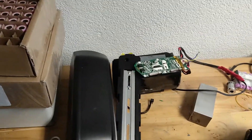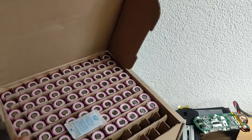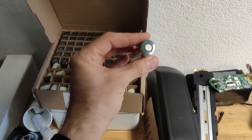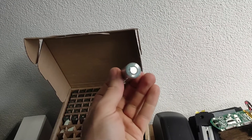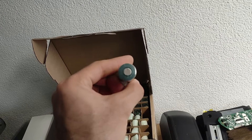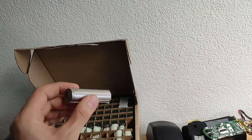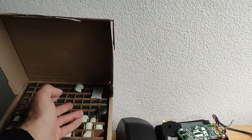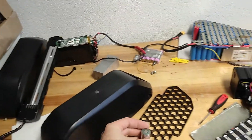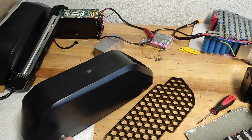But if you want a bigger battery, it's cheaper to go with 21700 cells. These are Samsung 40T — 4000mAh capacity and can deliver up to 30 amps. There's also the 48T, and from LG the 50, which has more capacity at 4800 or 5000mAh. So with those bigger cells you can build a much cheaper battery pack because it needs fewer cells.